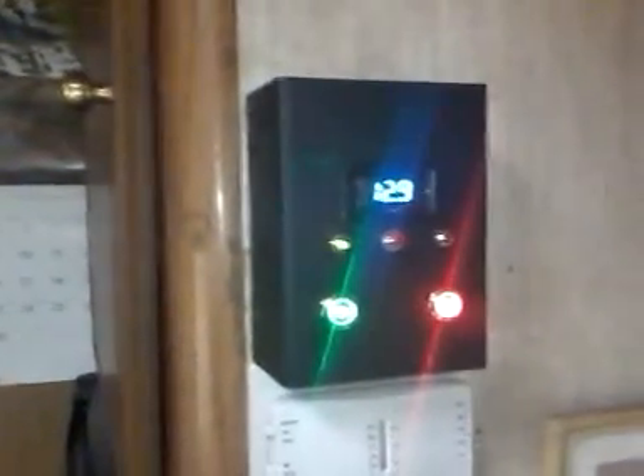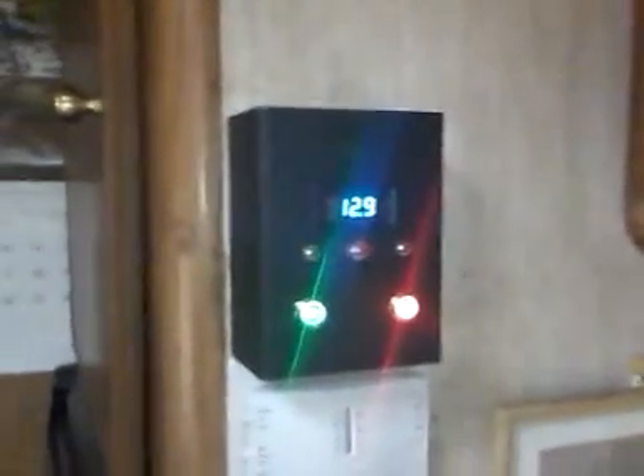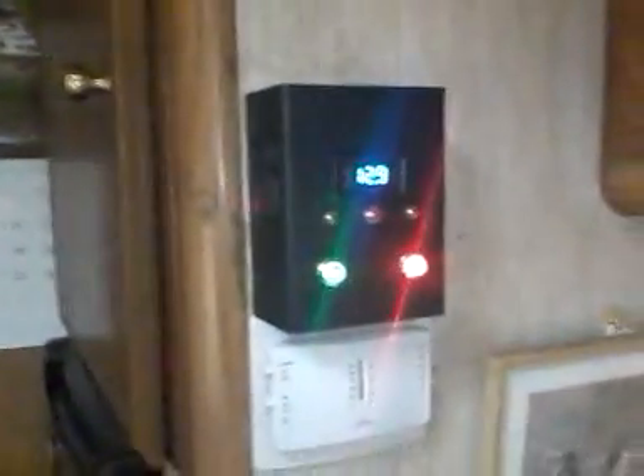On the one I made, it's a diversion type — it'll divert that power. All I got to do is hit a button. I have it in extended diversion mode where it kicks over for five minutes, or until the batteries become fifteen percent depleted, so it doesn't just sit there and switch back and forth like I showed before, which is better.